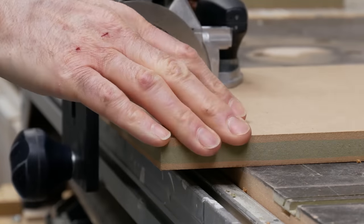Finally, let's go back to the Lamello Zeta to take a look at the Tenso connectors. This is kind of a self-clamping version of the Clamex, but it doesn't exert anything like the same sort of clamping pressure. This was the connector that had me most interested in getting the Zeta, and it was hands down the most disappointing when I first got them. It's taken me a long time tweaking the micro adjuster to get these Tenso fittings to where I'd consider using them for paying work.